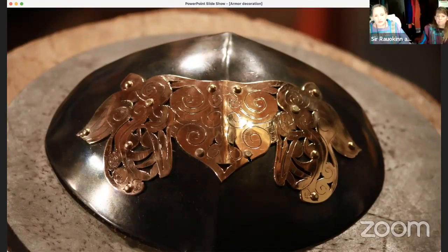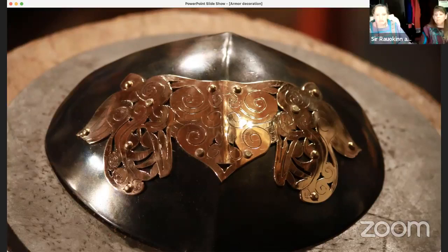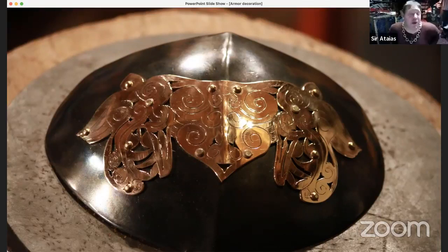How did you choose which rivets to anneal? This was just more like giving you an example. Okay. There was no method to your madness. Well, there was a method in that I wanted it to be symmetrical. Okay. So if I've got one that's annealed over here, I want its opposite to also be annealed. Same here and same here. And, you know, just give it sort of a sense of symmetry more than anything else. But in this particular case, to give an example of, okay, this is what it looks like when it's annealed, and this is what it looks like when it's not.